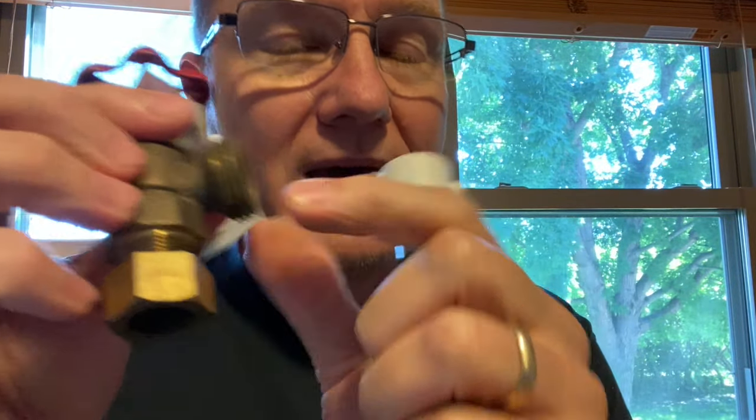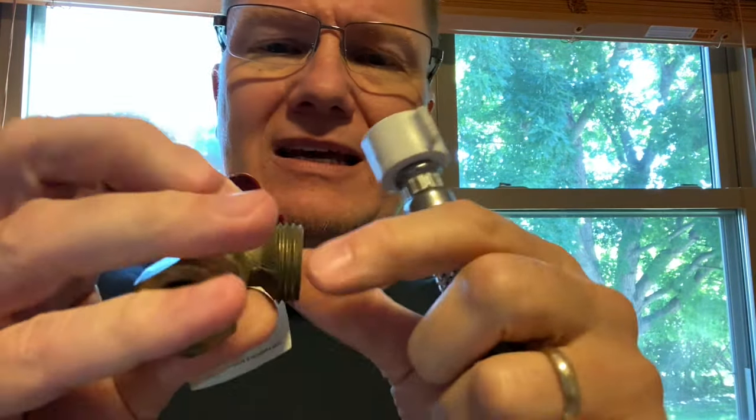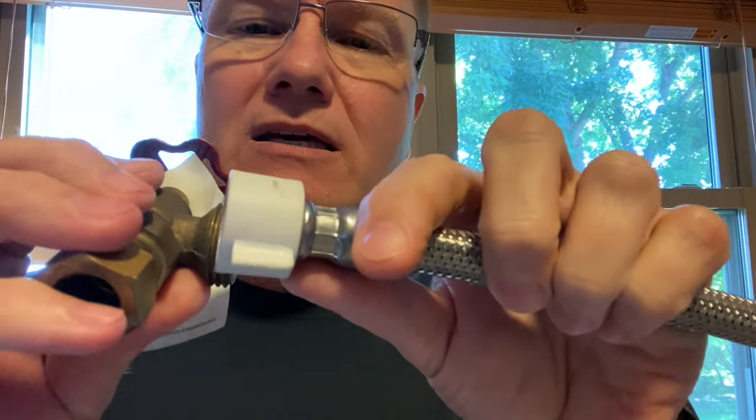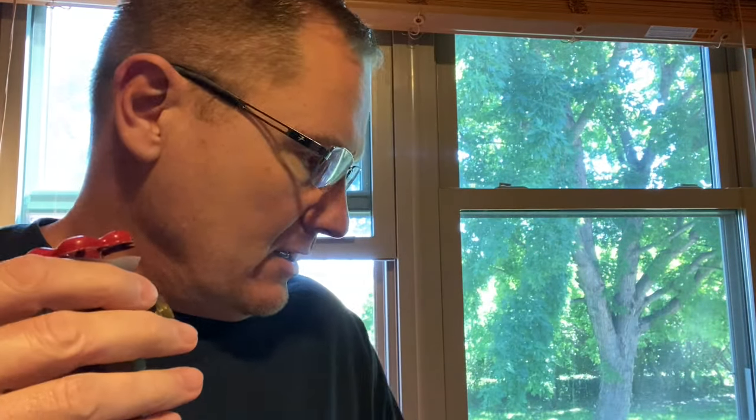If you can't turn the garden hose all the way onto the spigot, it's going to leak. Sometimes those little gaskets will become thinner or brittle, or maybe with one spigot it's fine but on another it can only go in halfway. In those situations, it may not touch to seal, so you have to get a different gasket. You can buy replacement gaskets at your big box store.